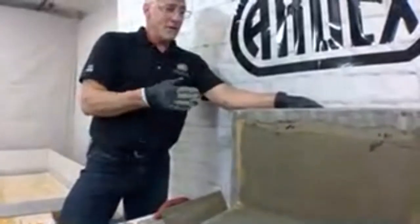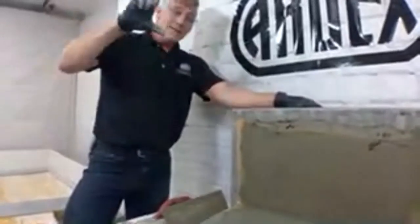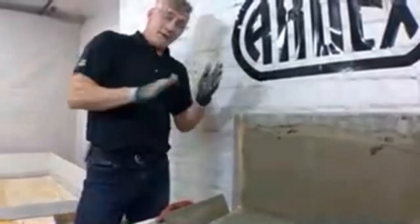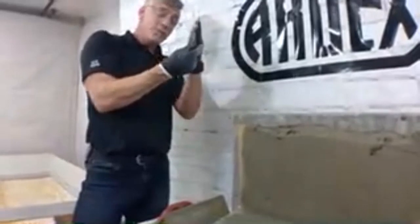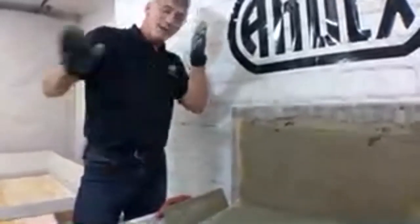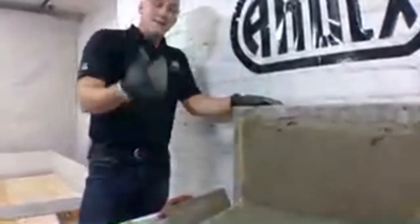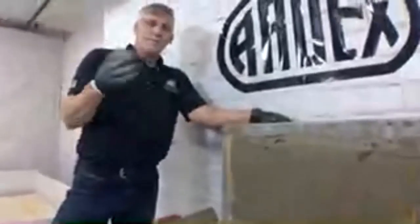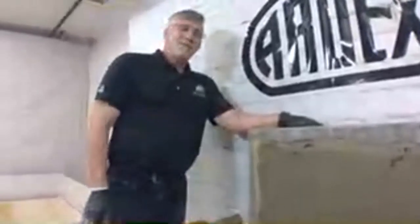I've actually gone out on pool installations where they're doing just the water line, and the tile installer is building out so that when they come in with a plaster coat, he builds it out with AM100, then he waterproofs it with 8+9, and that's stacked as an anti-fracture, and then he installs his tile, and then they bring that pool plaster up to it. So it's in a submerged application, so absolutely it can be used interior, exterior, submerged, commercial, residential. I mean, it's literally one of my favorite products.